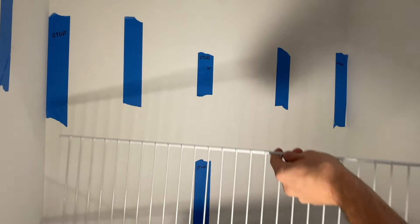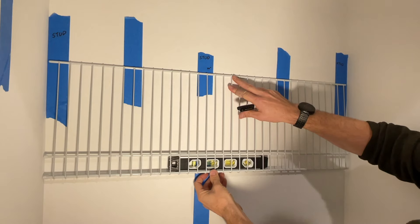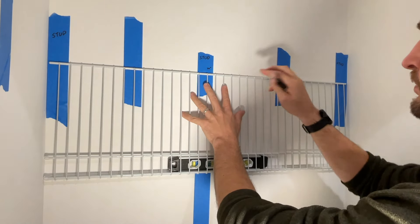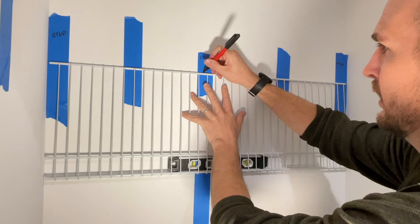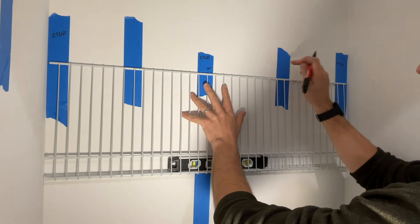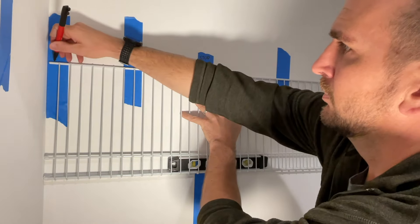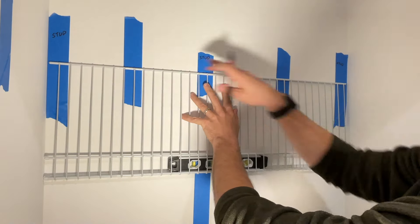First we need to know where we're going to be screwing the clips into the wall. I take the shelf and place my torpedo level on the bottom side, going up to the 70-inch mark where I want to mount it, and make sure the bubble is in the middle. I mark where each clip is going to go between the wires. Per the instructions you want no more than 11 inches of spacing, and I favor the ends to try to catch those studs for a secure connection. Now I have all the holes for the back wall marked and I'll start to mount the shelf.